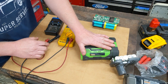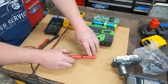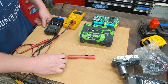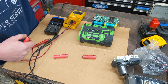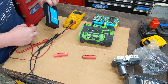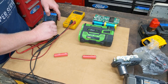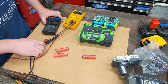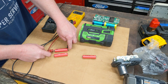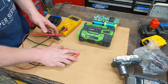Same with this pack — this one had 14 cells in series, back to back to back just in a straight row positive-negative to make up the 56 volts. Out of all those there was just one cell bad right in the middle. How do I test the cells besides just measuring voltage? I have just a super cheap universal battery charger — I think it even charges NiCads. I put the cell in there, and if it takes a charge and goes up, then I leave it for a week or so. If I come back and it's around 4 volts — this one's 4.16 and has been sitting probably about two weeks — that's a great cell. 4.16, 4.17 — great cells. So all these are great cells, let's make a battery pack.